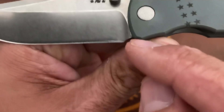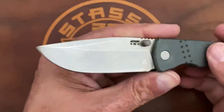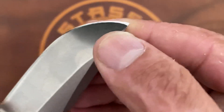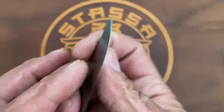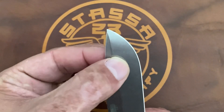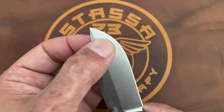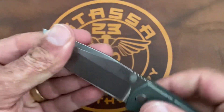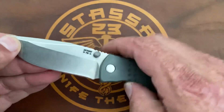Nitpicks and complaints: the edge termination — I wish they would have just brought that line out a little bit further so it would have cleared the plunge grind better and you wouldn't have that smile toward the back. Also, the sharpening job on the tip — it flares out a bit, and the tip is very thick. Whenever it starts to go into the belly it gets very, very thick and stays almost full thickness toward the tip. Even with that swedge it's pretty stout — not the end of the world, and I'm sure I could fix that after the first sharpening.